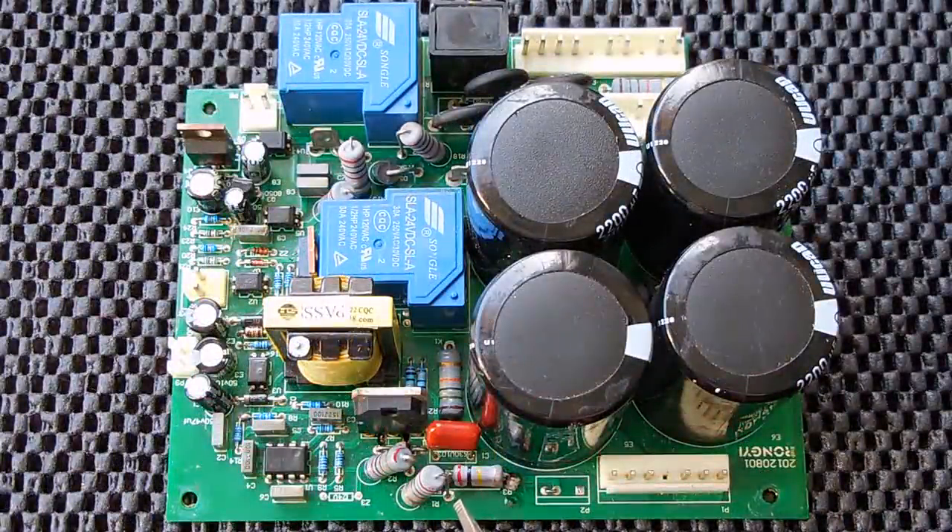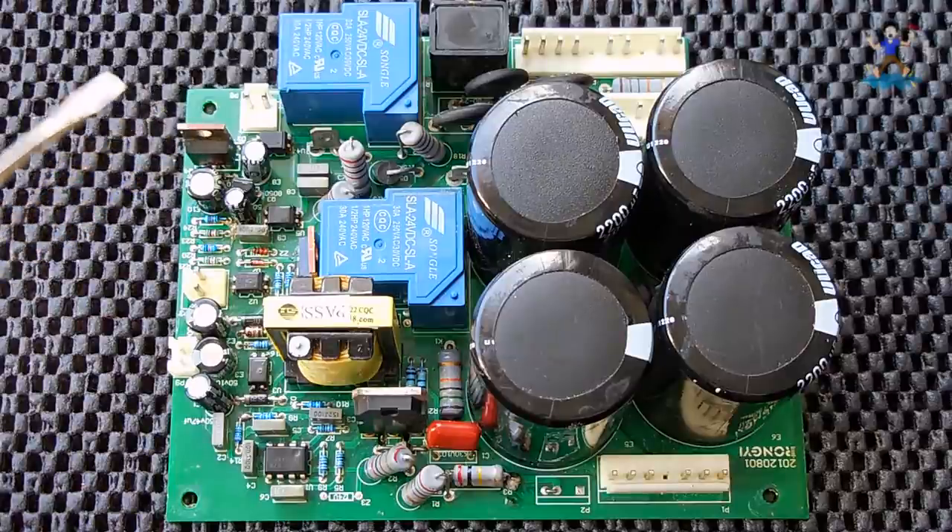Now let me explain what I did. The resistor that was discolored was definitely discolored due to heating. I desoldered the old resistor and checked it on my digital meter — the value was supposed to be 100k for a 2 watt resistor, and when I removed it it was around 120k. I did not have another 2 watt 100k resistor around, so what I did is take two 1 watt 200k resistors placed in parallel to get a 100k 2 watt resistor. I tested the MOSFETs on the board and made sure the drain and sources were not shorted out. When you test a MOSFET between the drain and source pins it should act just like when you're performing a test on a diode.